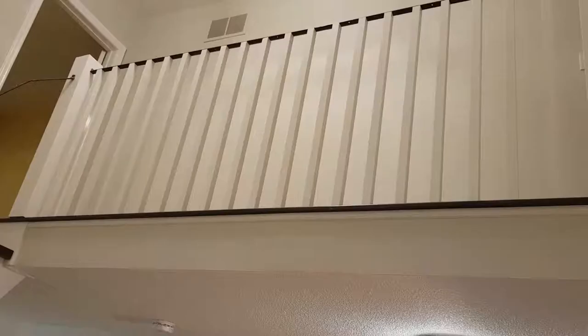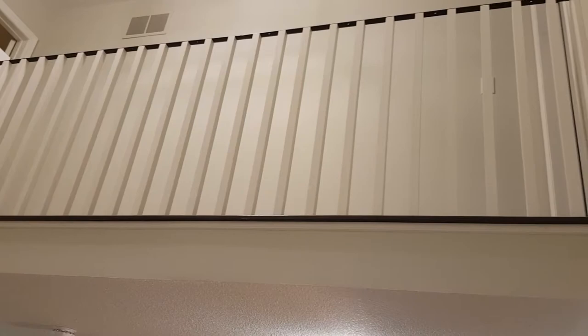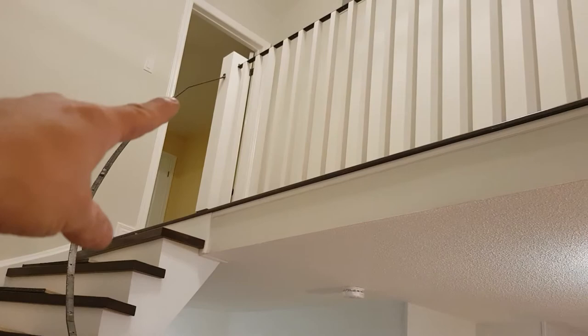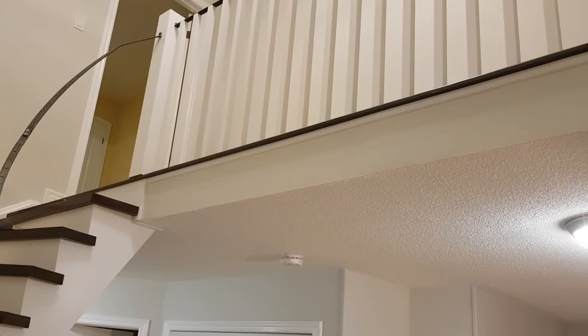I have put that one in already, and that was just cut 3/4 inch off each end right here and here, and welded the tab back on. I cut the tab off, the angle bracket tab with a hole in it, and I've welded it back on. One here, I cut this one off right here, moved it back 3/4 inch and re-welded it back on.